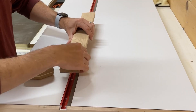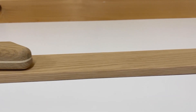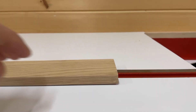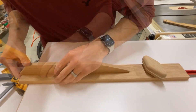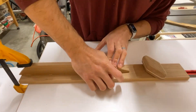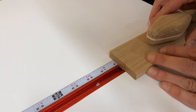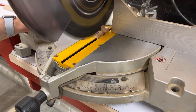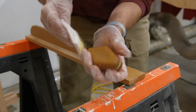I clean up the remaining bit with a chisel. Everything fits well and the knob works, but I notice that the long, narrow shape of the stop block seems to bow a bit. To correct this, I glue on a stiffening rib and clamp the stop block to the table while the glue sets up. As a last step before applying finish, I position the left side of the stop block to exactly 20 inches and cut it to length. Then I wipe on a protective coat of boiled linseed oil and let things dry for a few days.